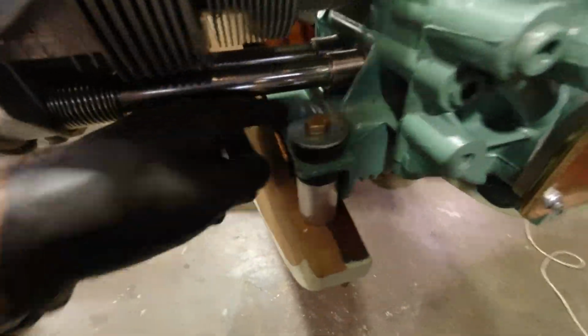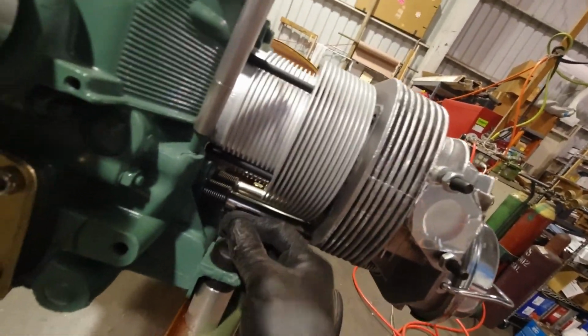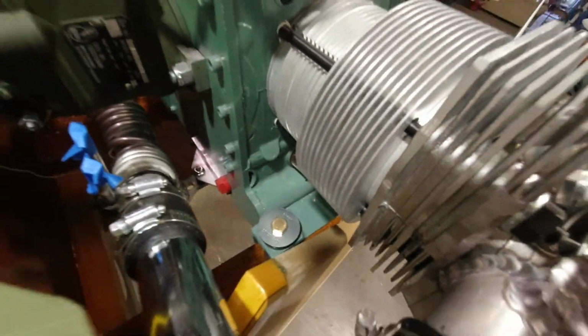Okay. All right, so I've got three of the bolts through. This one I could not do. The cylinder is just too far forward to reach it, so I just had to put a shorter bit in there and mark it. I'll have to drill that one off of the plane, but the other three were no problem, so I just used a 12-inch bit and just protected the cylinders with a towel while I did that, and it worked out great. Now, Parker is going to be stopping by today, so when Parker gets here we'll be able to pick the engine up off of here again, and then I can actually drill that fourth hole and get that in place.